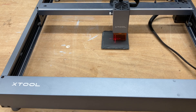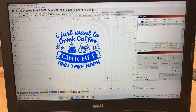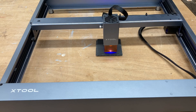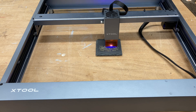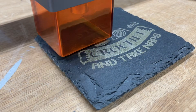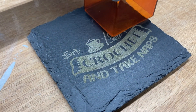So you can see that method worked extremely well. Let's go ahead and make the change and engrave this. This shows you just how easy it is to take an image that someone sends to you and have it ready to engrave in just moments. I'll turn off the outline line and turn on the output for the blue fill — that's the only thing we'll engrave. Let's grab the glasses and hit start. This particular engraving is taking about 30 minutes. There are multiple ways to speed this up, but that's for a different video — I wanted to concentrate on just the positioning of the tile in this video. The XTool laser is doing an absolute fantastic job with this engraving.